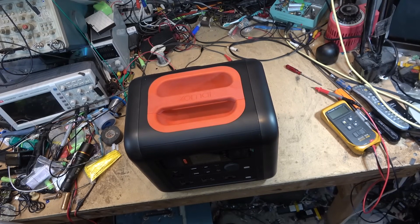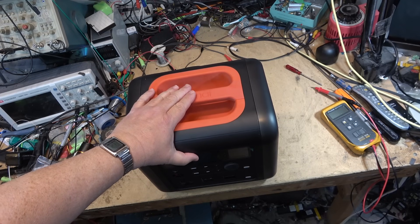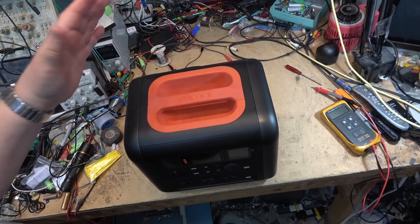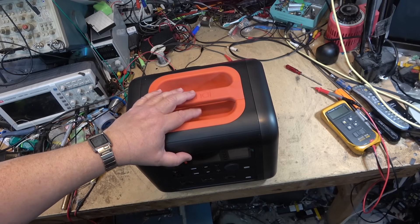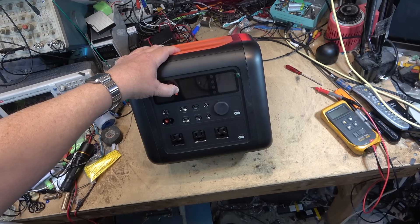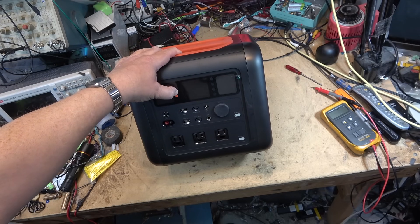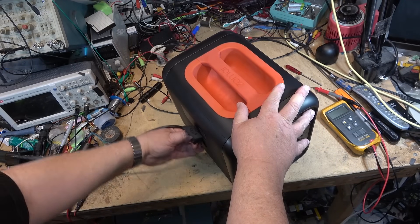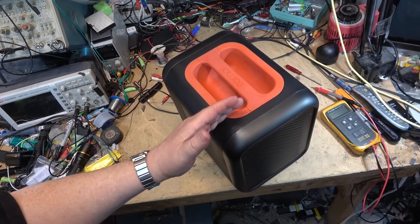It's been sitting for two and a half years. Just yesterday, because you want to put a charge in these things once in a while - you don't want to let them sit so they can go completely dead - I finally got to it and figured I'd plug it in and charge it up. Well, it's plugged in, it's dead, it won't charge, it won't turn on. The battery pack has failed because internal cell discharge has allowed the battery pack to get too low. Lithium battery packs, when they get below a certain point, will shut down.